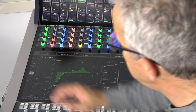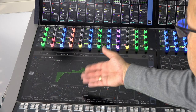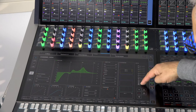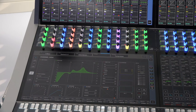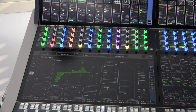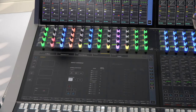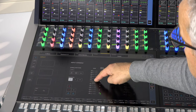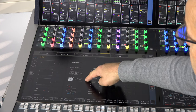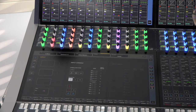You also have a channel overview. For your selected channel you get an overview of your input settings, your dynamics settings, and the routing where the channel is going to. In the channel view you also find the channel fader, mute button, isolate button, and auto mix button. From the channel view, touching a module takes you to its detail view. For example, the input section of a channel has a ±60 dB gain, settings for different stereo modes, the ability to toggle between two different inputs or sum inputs A and B, generator activation, and polarity switch.